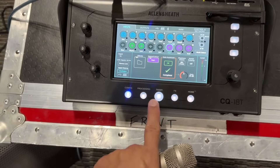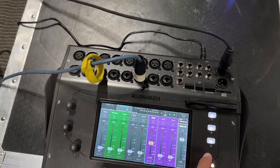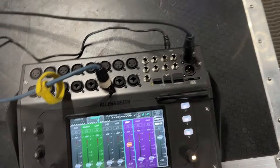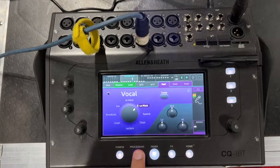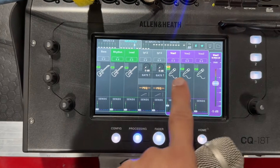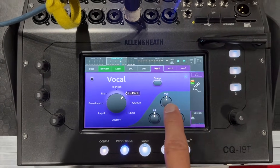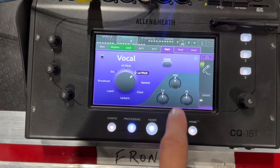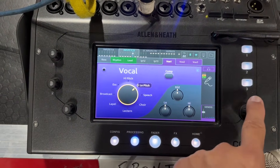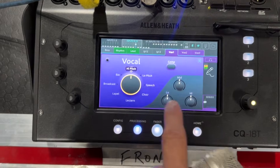Now that I've got my gain set I can look at my fader and bring up my volume. I've got a powered speaker here on the floor plugged into my main output. If I look at my processing on my vocal channel, you can see you get presets like microphones, guitars, and things like that. If I tap on that I actually get my vocal processing — this is not flat, it's in addition to the vocal processing that's laid down behind it because it's picked as a vocal channel. So I can pick whether I want to be more high pitch or more low pitch, doing a lectern or choir type setting — some basic settings that do processing behind it.